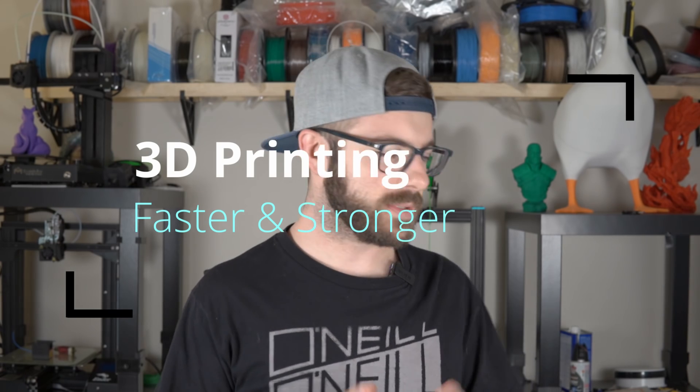It's a pretty common thing that I hear people say that 3D printing is slow, especially people that are new to 3D printing. There are things you can do like bump up your printing speeds on a well-tuned 3D printer and get some pretty decent speeds, but there is a tipping point where your printer cannot possibly lay down filament and cool it quick enough. So your prints start to look not as pretty, their tolerances go out of whack, and the parts just end up not being usable after a certain point.